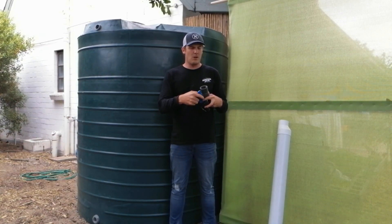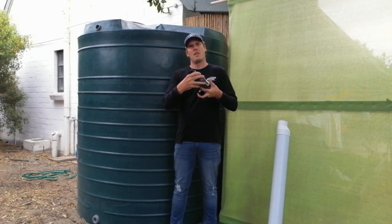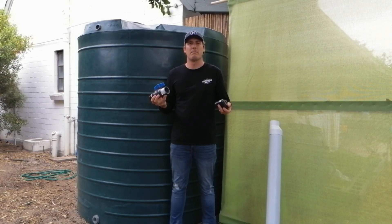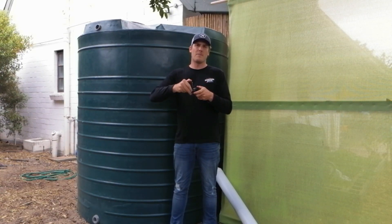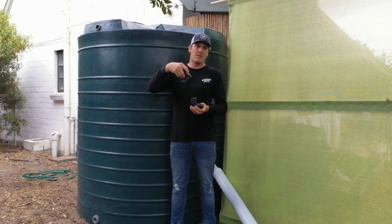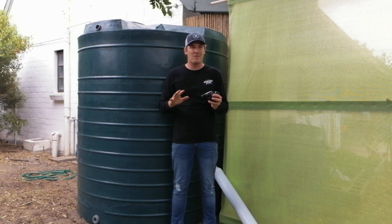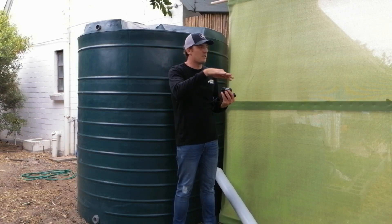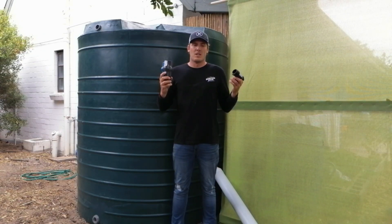Then we've got quite a big ball valve, just so that we're not putting any pressure on the actual valve. This will screw into the tank and then connect into whatever we want — our drip system, our pump, whatever the case may be. We also have the same screw system for the overflow at the top, with an L-bracket down and a second L-bracket to take it from the ground overflow out into the rest of the garden. Our aim is to have a zero runoff property, so when this tank is full everything goes into a separate draining system so the garden is always absorbing and nothing is running off.